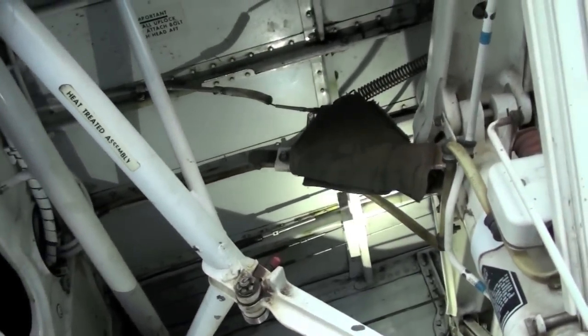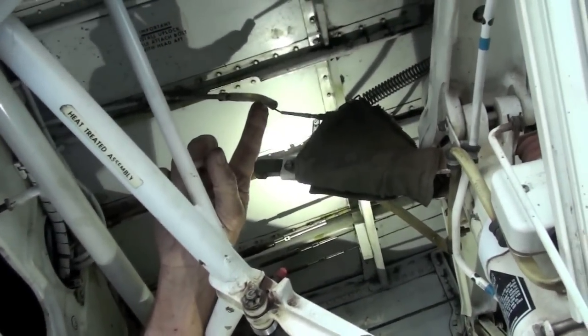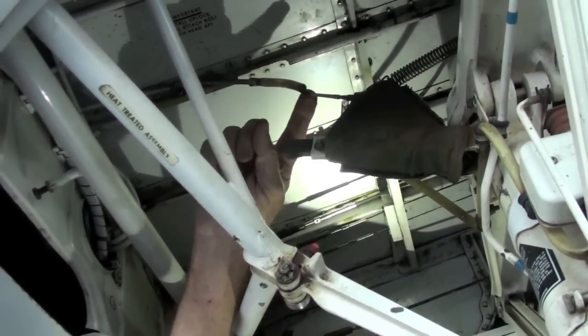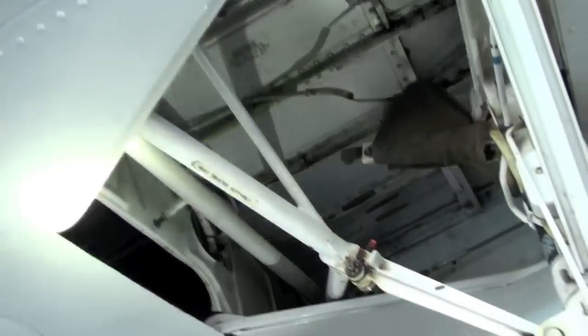We never put grease fitting caps on that roller because it will hit this cable when we go in the up position. You'll see that in just a minute. Make sure this roller is free. Make sure you can see 3/8 inch of the end of the cable. And no fray. The cable's not frayed. Okay. Beautiful. Everything else up in here looks pretty good.